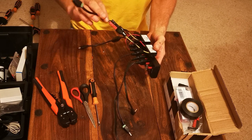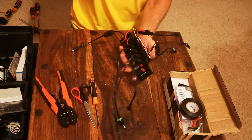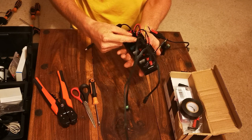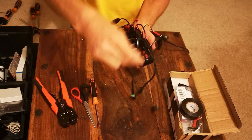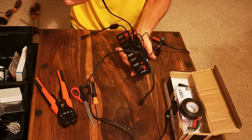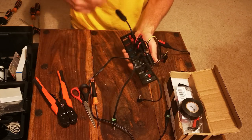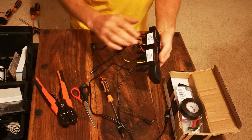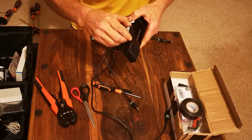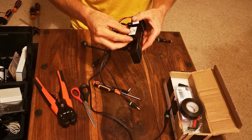We've got one 5-volt converter for the USB hub and one for the Raspberry Pi, both powered by two ports from the 12-volt splitter. Then we have a slightly longer one for the main imaging camera, one for the focus cube, and another one for the dew heater with the 12-volt step-down. It's tough stuff but it works like a dream, wired up neatly.